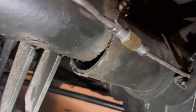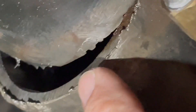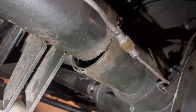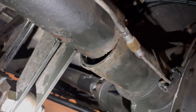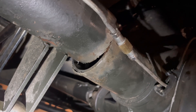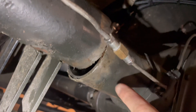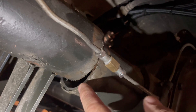Taking a closer look at this, we can really see why this failed. This was a complete failed weld — a garbage weld. You can really tell that by looking at the edge of the tube here, how it's still flat and cut smooth from the saw. This all should have melted in — if this was a good weld, this would not be a flat edge here. The reason that happened is I was using a wire-fed MIG welder and I didn't have the heat settings right. So it was putting down a weld, laying a bead, and it looked fine at the time — it had a pretty little bead going over the crack and I thought it had penetrated pretty well. I don't really know how you know with a MIG; it fills in with filler so fast you don't really get to see how deep it's going. After I laid the weld down I smoothed it all out, just thinning it even more. Just a really terrible job welding this.